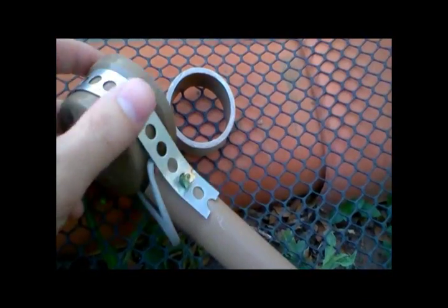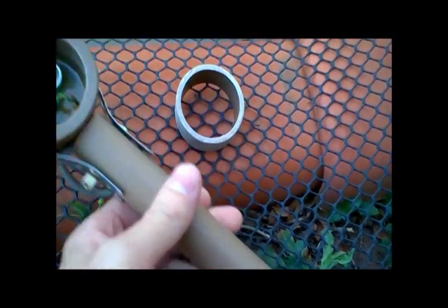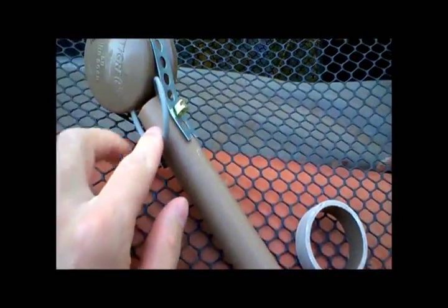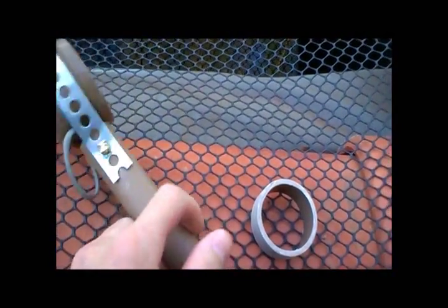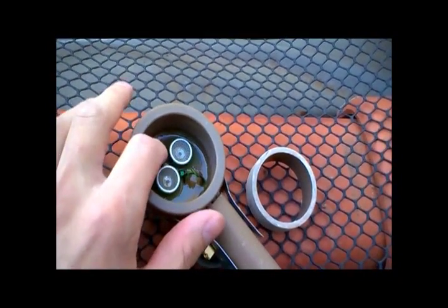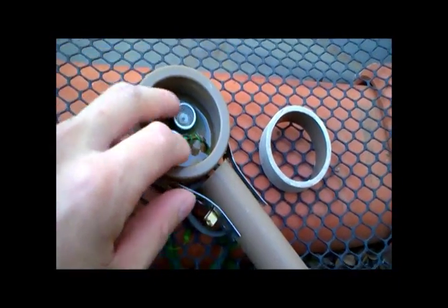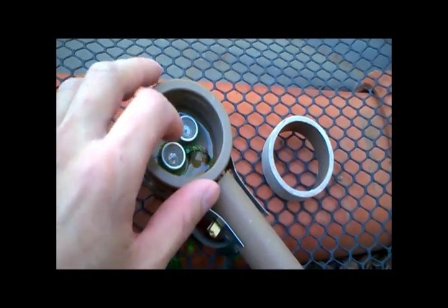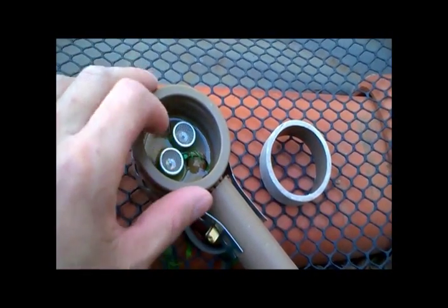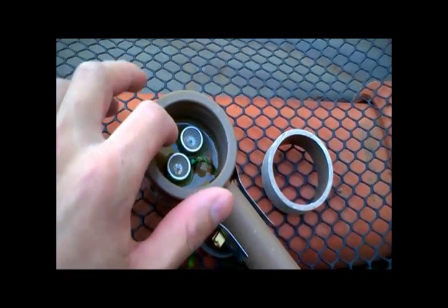I mount it with this bracket and this tie into a 25mm PVC pipe, so it can go all the way in the fish tank like this. I ran the cable from inside the main PVC pipe. A quick tip about mounting the sensor like this: you want to fixate the sensor so the epoxy will have no worries about holding it. So I hot glued the ultrasonic sensor in the bottom, and then I poured the epoxy resin.